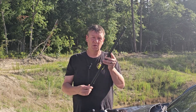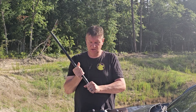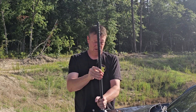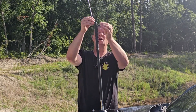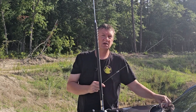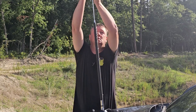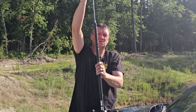The HF008 portable telescoping antenna isn't really telescoping at all, but it comes with a base-loaded coil. Assembly is pretty easy and fast: screw the loading coil to the base, then screw on the extension rod. It comes with two different sizes of whips — the small and the large. Most bands will use the small; some will need the large. It just screws to the extension piece.